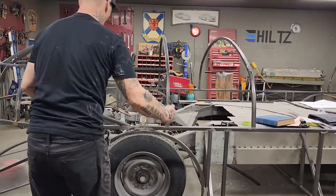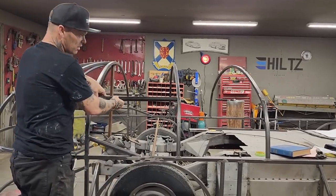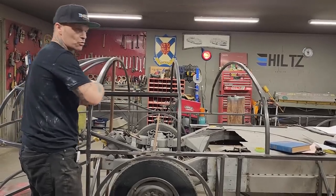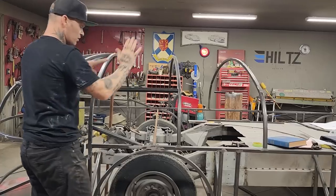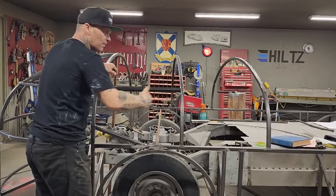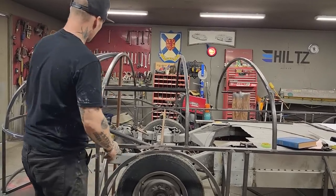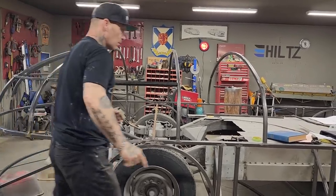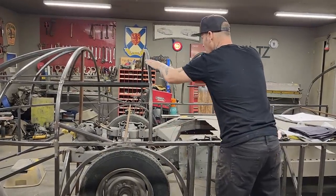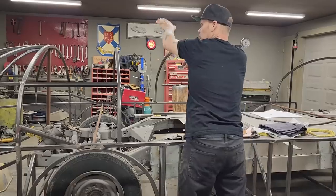Then I'm going to take that piece and we're going to roll it right up around, probably to the center, and there will probably be one of these in there that's just stuck in there, not welded right now. That's going to keep my roof rafters, same as your house, if you were strapping your roof rafters so they all stay together. This is a piece that I'm going to put in to make it all stay at 4 feet, or 2 feet center, and that way I can put a 4 foot sheet of metal on here and run it to the center. I'll tack it all the way along the center here. This roof rafter will be in the middle of the metal so it cannot fall. There'll be another piece running from center there to there. So when I roll it down over, I can tack the metal.